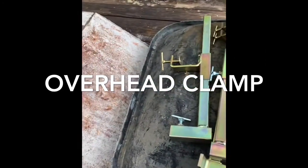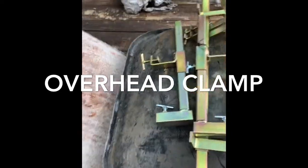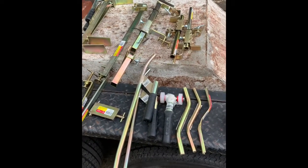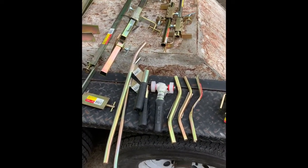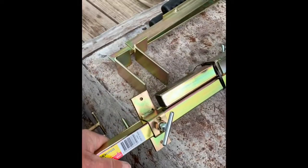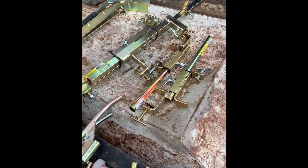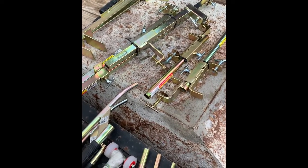This right here is actually a profile for wood, because over here in the states everything's built out of wood and we build what we call donkeys — or L-brackets. That part right there is where you screw or nail into the studs on the sheathing, and then this piece goes on it so you can gauge your profile to make your corner pole plumb and exactly how you want it. That's something we don't really have in the states and I'm excited to use it when we brick a house — it replaces what we build out of wood and it's really sturdy.